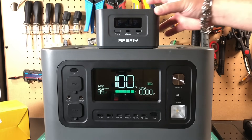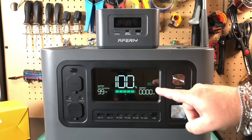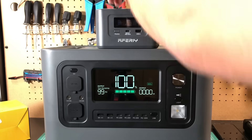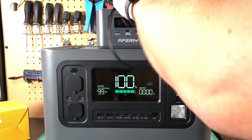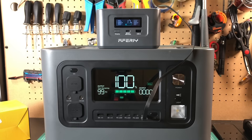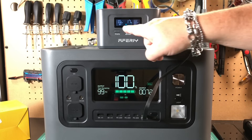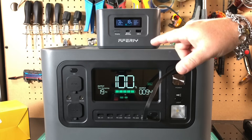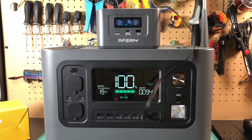Here's where it gets really cool. When we want to charge this thing quickly, this is the A3 AF210 — my bigger home power station — which has a PD 100-watt output. All I have to do is take the USB-C cable from the top of the Nano 100 and plug it in there. Let's turn on the USB and watch as this starts to ramp up — we're going to see 100 watts charging. One thing to note: if the battery is below 5% charge, it'll charge a little slower until it hits 5%, then ramp up to 100 watts. At 100-watt input, this is going to charge fully in about 52 minutes. That is awesome.